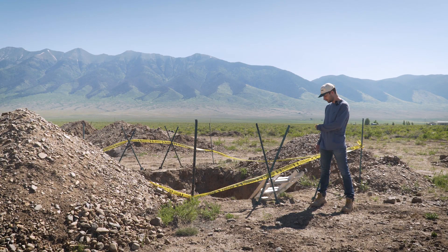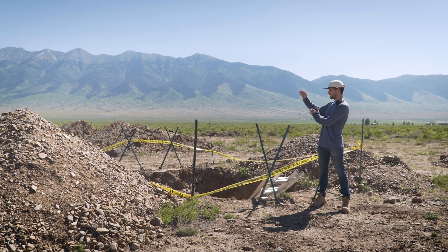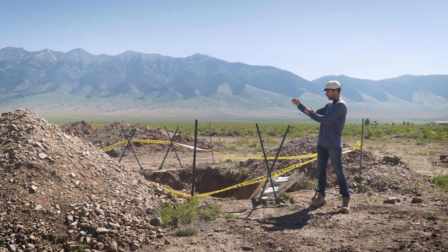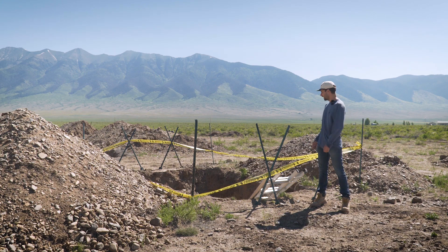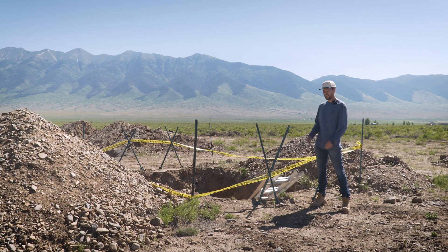It's now Wednesday. We've got the truck coming to deliver the tank into this hole in about 30 minutes, so I'll pull down these stakes and get the ladder out - hopefully it's a pretty easy job. That will then give me what I need in terms of angles, because there's not perfect alignment between the tank excavation and what I've got for the leach field. I'll work out the angle on that, see if I need some little angle adapters for the piping, and then with all my infiltrators I'll be able to make sure my spacing on the manifold is perfect for them to all run straight down the middle.